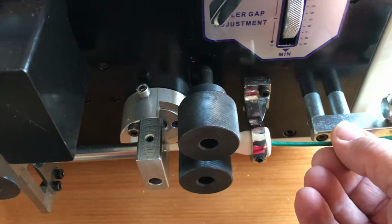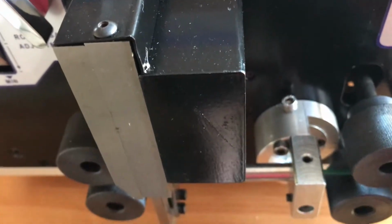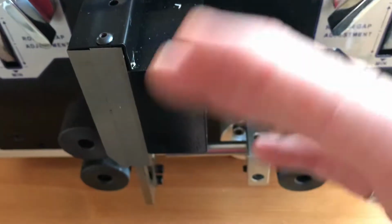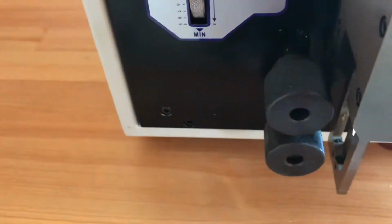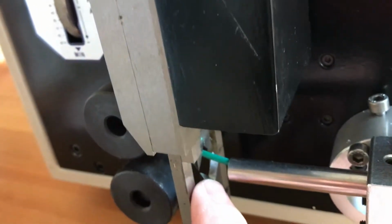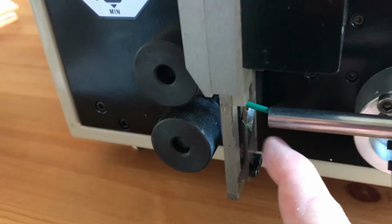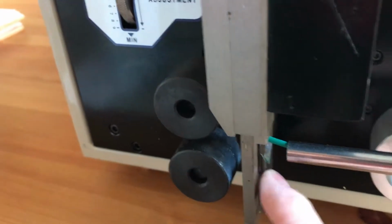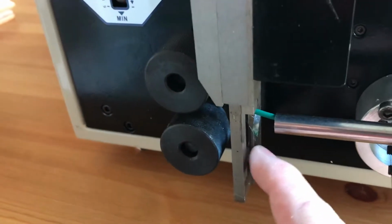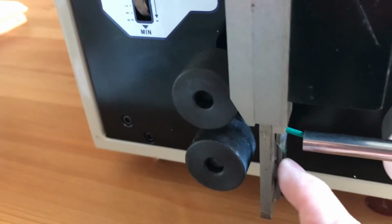Feed it through into there, through the pinch rollers, and then in here we're going to go into the guide that actually rotates for the cutting. So that's going to go through there, through the blades. These blades are very hard, very sharp, and they can be resharpened. Most machines you have to buy replacement blades, but these can be resharpened, and MGR Electro in Italy provide a resharpening service for these. It's unlikely you'll need any alternative blades, because this will do your cut and strip.